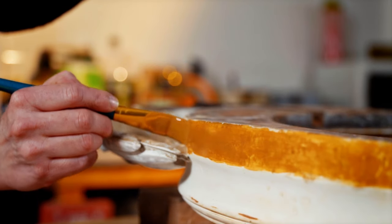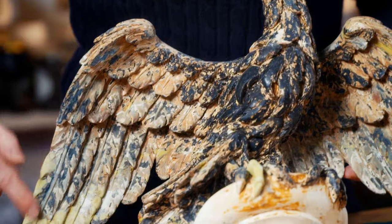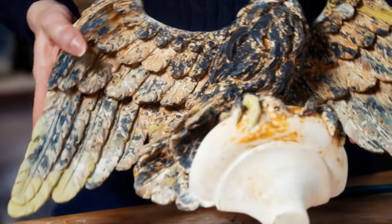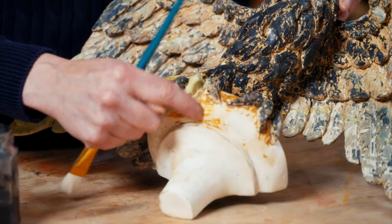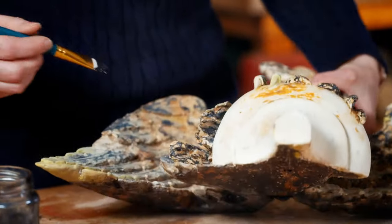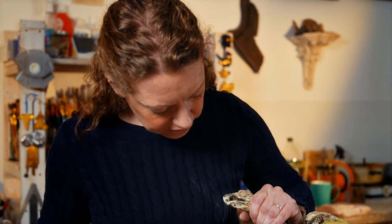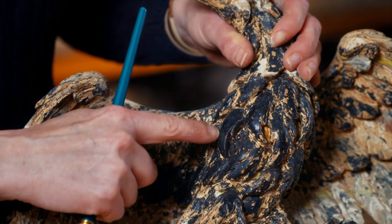I think if you're working on something this old, to put something like a modern acrylic on this would just be wrong. The final job is to paint the eagle with another batch of Ruth's homemade paint. We've got loads of different things going on here — we're back to the wood in places, we've got some repairs. So the paint's just going to even all that out. That is going to be gold so I'm going to leave that alone and I'm just painting the eagle. I'm quite happy with the colour match; once that's had a few more coats and I buff it, that's really going to look nice. I've just got to put all the gold on the mirror and finish off the eagle, and then I'm ready for Karen.